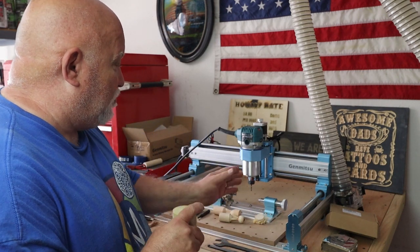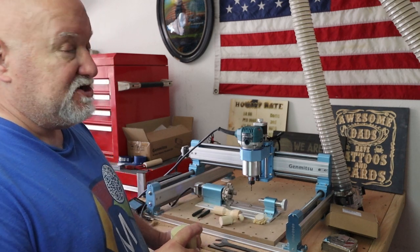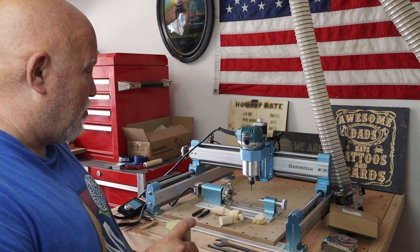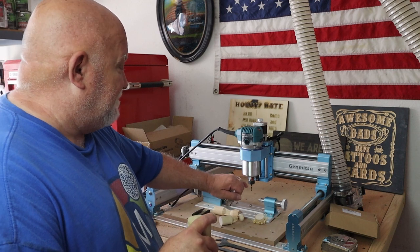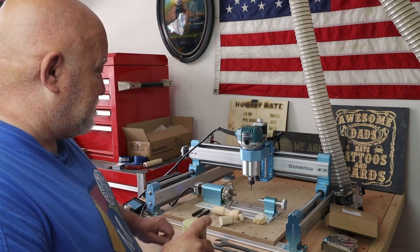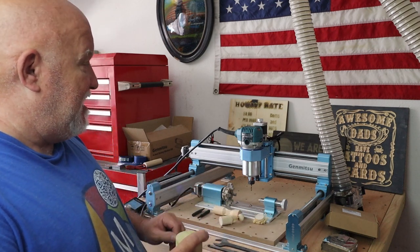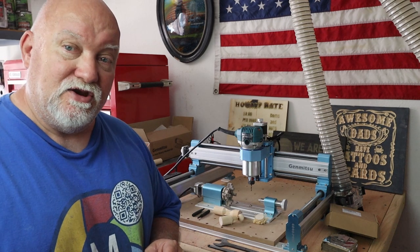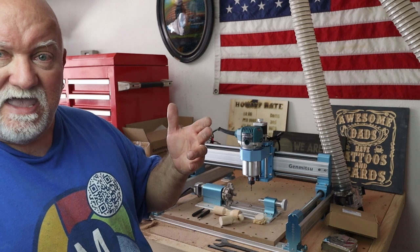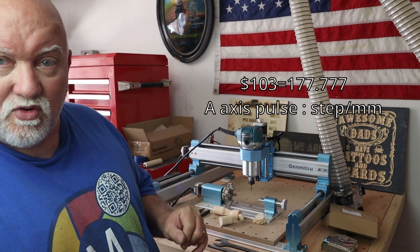The test file that came with this works from right to left — it does not work left to right, because I tried that the other day. I homed everything on the right side standing by the emergency stop button. The minute the bit lifted up, it took off heading towards the chuck, so I had to hit the emergency stop. This file is designed to work from the right side to the left side. And when you load up Candle, you've got to run a specific command on the command line — I'll put it on the screen — to get everything set up right.